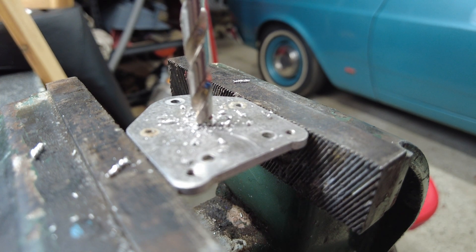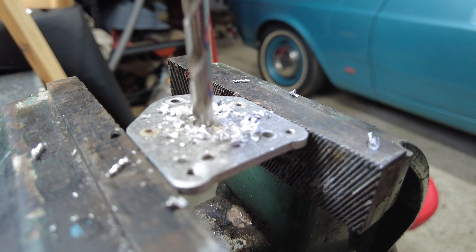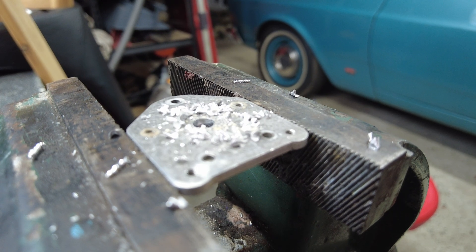Now I'm going to follow through with the correct drill size — in this case 6.5mm — running the drill at a lower RPM. You can actually see there, when I was breaking through the material, the amount of friction was enough to stall the drill, requiring me to add more torque. If you are holding the work by hand at that point, you are likely to lose control of it — and then, well, it's up to the gods whether you're going to keep your fingers or not.